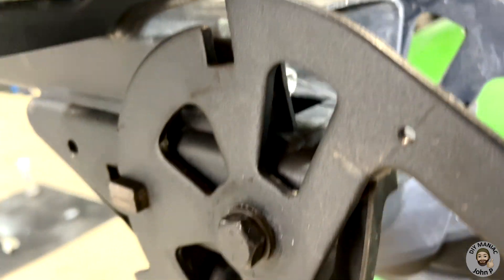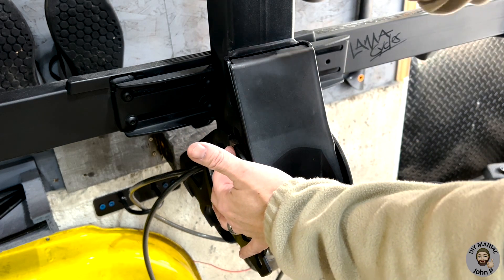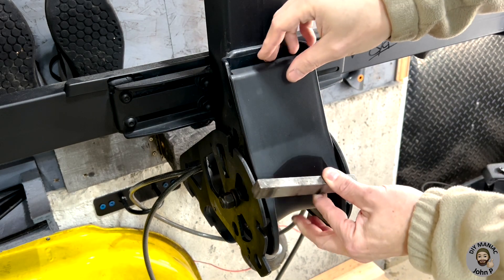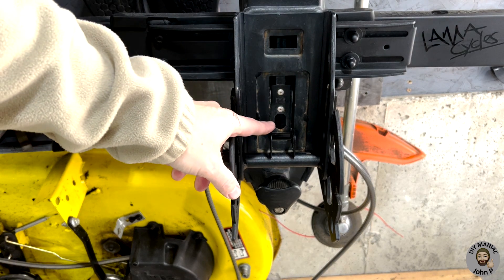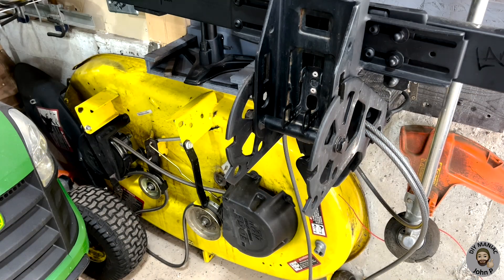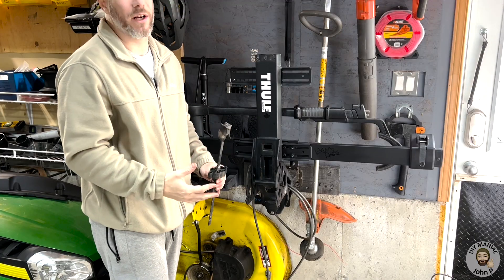We're going to remove this locking slider pin. It will be easy to slide out as we no longer have tension on it from the spring. Do keep in mind when you take this out, there's nothing now holding the rack in position, so have a hand ready just in case it wants to fall on you. Pull the pin out - now with this out it will allow us to remove the back plastic portion. The next step is to remove the linkage from the center section. In order to do so we need to drill out the two rivets that are holding on the arm that connects that sliding lock pin.